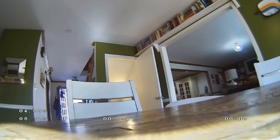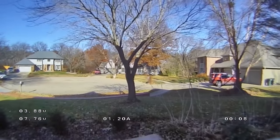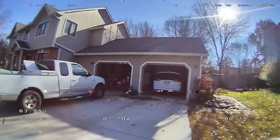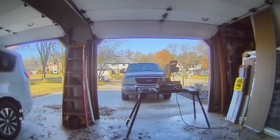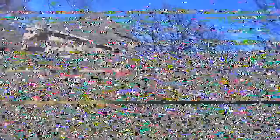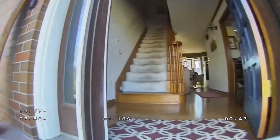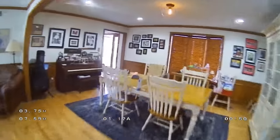I've selected this flight to show you first because I fly both inside and outside the house — it's the quickest way to get a feel for how it appears in my environment. The board in this whoop is the Crazy Bee F4 Pro V3, which has an integrated D8 mode receiver, so I don't have a long-range receiver on here. I'm sitting inside the house and I've flown around the outside, which has a brick face. We get some breakup, and as I go around to the other side it gets more severe. My radio kept hollering RSSI critical, and I really expected it to just fall out of the air at any moment, but I turned around and came back inside.